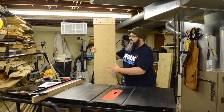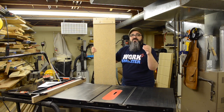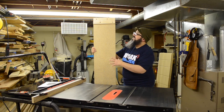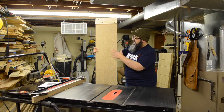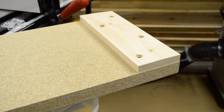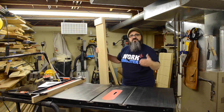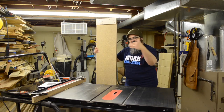We used this tool right here, and it was really simple to make. For those of you who aren't patrons, we have a board here — just pressboard about 1⅛ to 1¼ inches thick. You want it really nice and thick; maybe two sheets of ¾-inch MDF laminated together. You want it to be really rigid so that when it's fed into the thickness planer, you don't have to worry about it bowing.